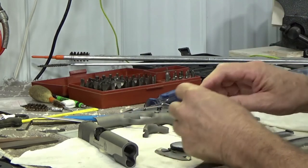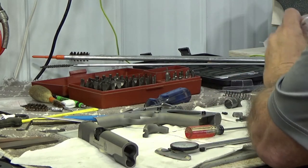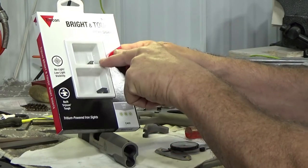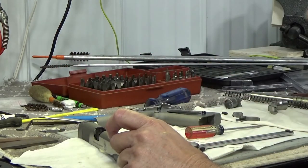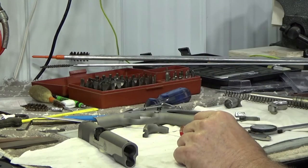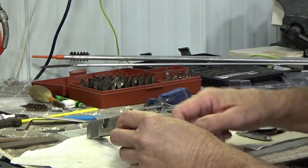Not knowing that, a purchase had been made for aftermarket sights. The rear sight would work, but the front sight was built for a Colt 1911, and the Colt 1911 has a much smaller, thinner tenon — it ended up not fitting this particular frame. We were looking for an 84 to 85 thousandths tenon, and this one was about 55 to 56 thousandths. If you used it, you'd have too much slop in the hole and would never get the sight tight like it should be. So we had to back up and order a different size front sight with the correct tenon to fit this slide properly.